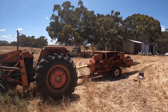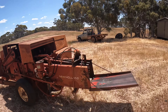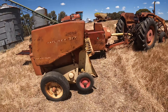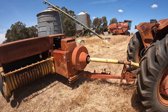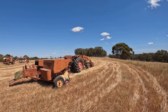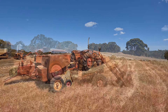The last thing I like to do before heading out with any piece of machinery is to start the tractor, run it at an idle, have a walk around it and a look. Make sure everything is working properly, nothing is catching, everything is turning the way it should and sounds the way it should. Balers always make a fair amount of clanking and rattling, but this is a really good moment to pick up any problems. Then we're going to head off and do some baling, and I'll run you through driving the tractor and operating the baler as we go.